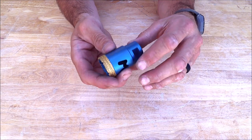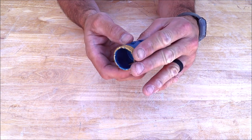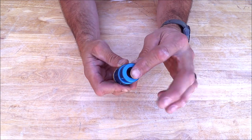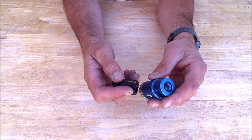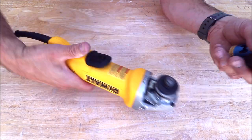Honestly, you definitely want to add some water during your hole saw cuts so that these diamonds last a long time. Great looking hole saw. It comes in a 5/8ths arbor or an M14 — this is an M14, so I will use my adapter: M14 to 5/8ths for my grinder.